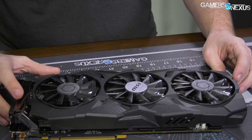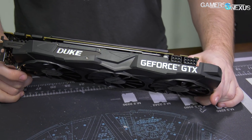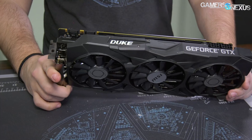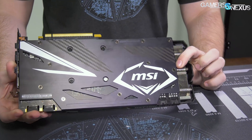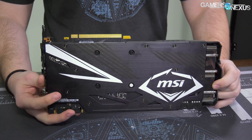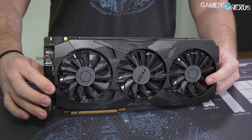But there are three of these, so you can't fit two larger 100 millimeter fans with them. For power, it's got a six and an eight pin. It's got a traditional backplate, some LEDs, and no BIOS switch — so no dual BIOS. Lots of just Phillips screws, and then there are some heat pipes and a standard heat sink. So we've pretty much seen the whole card. Let's take it apart and get the actual details.